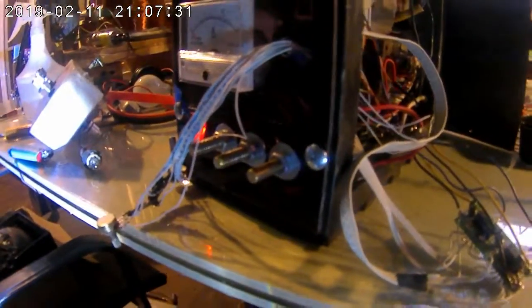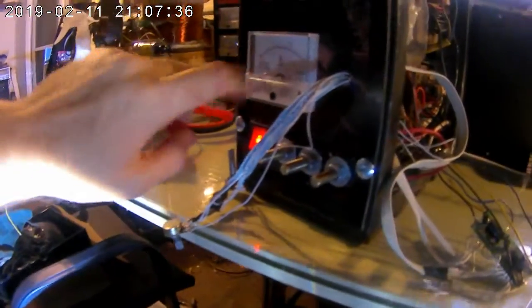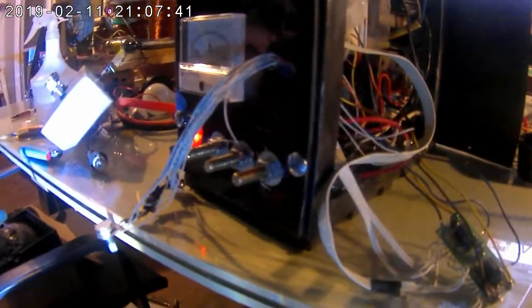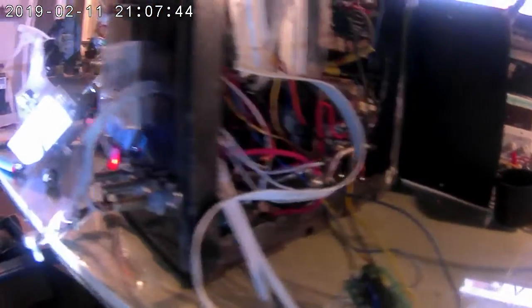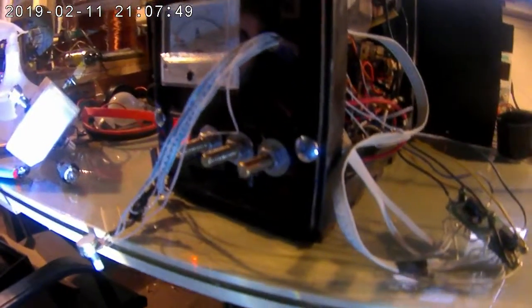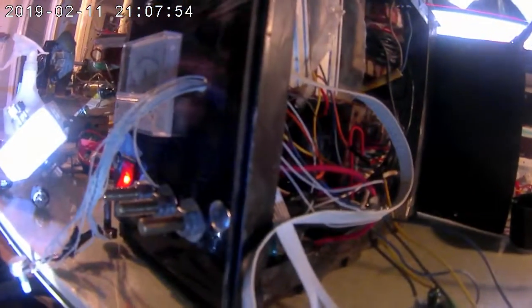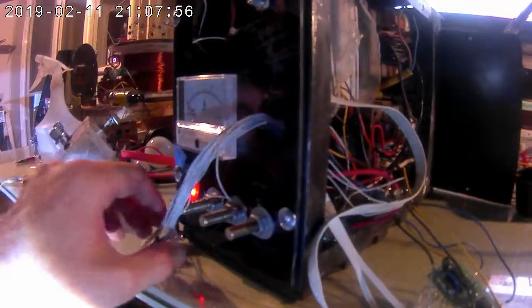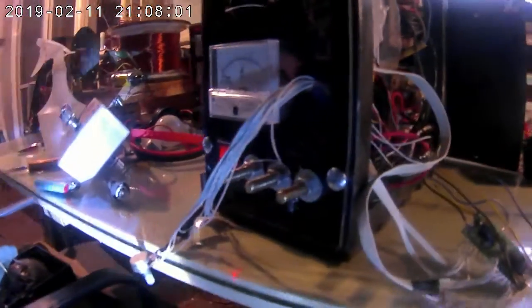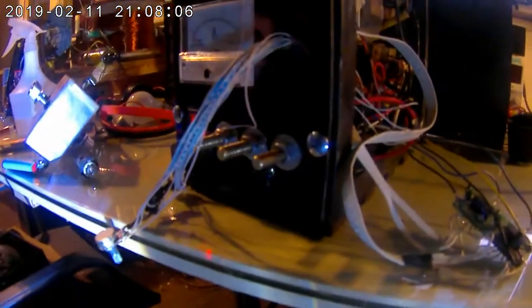But as long as you only do it for a second or two at a time — because that'll be pumping well nearly 15 amps at zero volts, going to get hot extremely fast. This power supply is really happier at its top setting. That's really all you've got to consider — it's not so much a short circuit protection issue, although it does handle very brief short circuits. The current and voltage regulation are both fantastic.